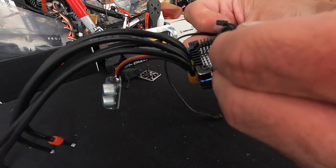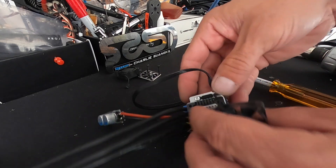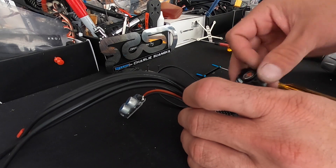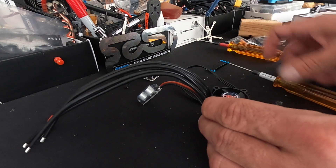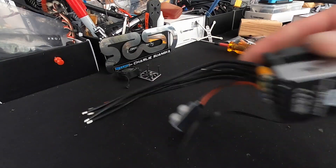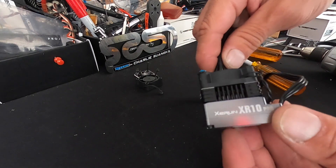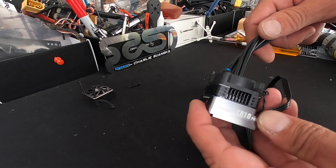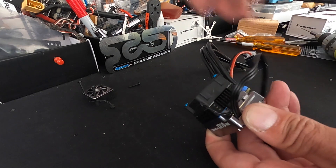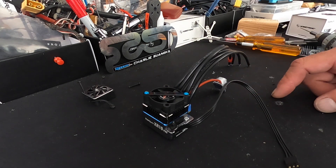I'm going to plug the fan in — it's keyed so you've got to make sure you line that up. I like to twist the wires so they don't move around a ton or get hung up on stuff, but you can't twist them too tight. I'm going to put the wire on this edge to keep it away from the programming port. Fan stuff is nice and free — it's on there nice and snug. Look at how much bigger that is over the stock fan: a 30 millimeter fan versus a 25 millimeter fan. That's a nice big beefy upgrade. The heat sink upgrade works on any of the XR10 Pro models — it sits right on top of the factory heat sink, lets you bolt a bigger fan on there, and still retains tons of airflow. If you have any questions, comments, or concerns, shoot us an email at northamerica@hobbywing.com. Thanks for watching.